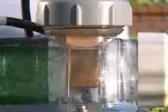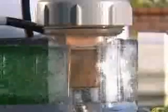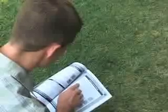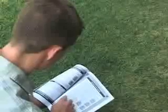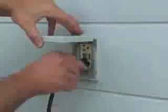Small amounts of natural chlorine work together with copper ions to keep your pool water fresh, clean, and comfortable. Refer to the salt table in the owner's manual for the amount of salt you will need for your pool size. Before adding salt to the pool, make sure the saltwater system is off. Turn on the filter pump to circulate water.